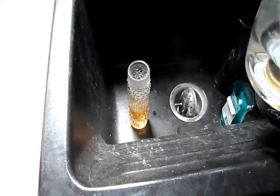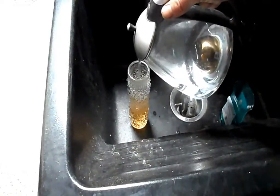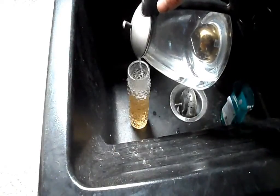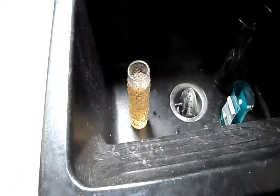The acid is then added to the vessel first before water is added. I do it in this order because adding acid to hot water is way too vigorous a reaction and can often splash on myself. This way, when I add water to the acid it is at the bottom of the container so it can't splash up very easily.